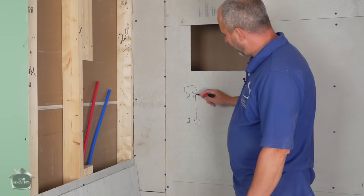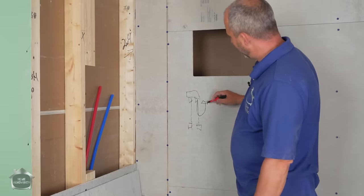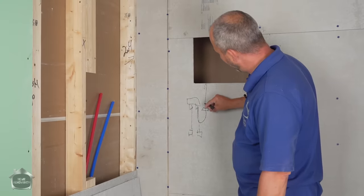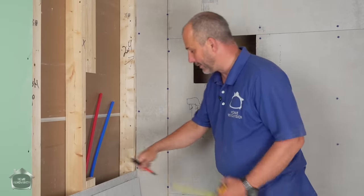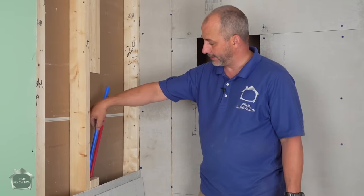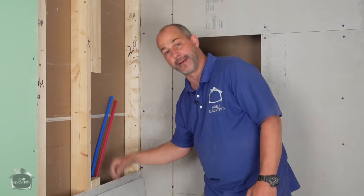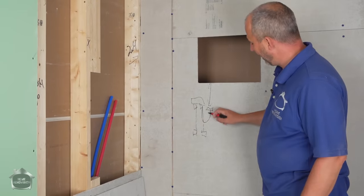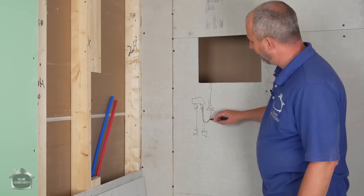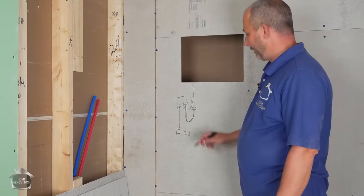And so what's going to happen is I'm going to have it turn up like this. And I need my water supply traveling down through the hole towards it. So I'm completely opposite of the way I am right now. So I'm actually going to have to cut the line, put in an elbow, and redirect these water lines coming down so that when I attach my water supply, I can have a nice comfortable curve and not risk kinking it. Wow, that is really interesting.